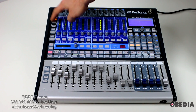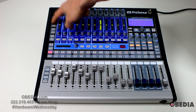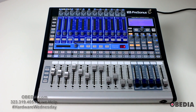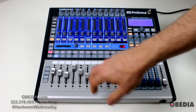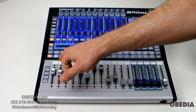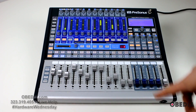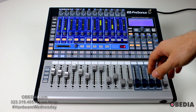The encoders are also multifunction. You can take control of many different features using the encoder strip on the left-hand side of the unit, including controlling the graphic EQ, your FXA and B sends, and your four auxiliary sends. You'll notice a FireWire button on some of these digital mixers from PreSonus — that's important because it allows you to control that channel strip utilizing FireWire on your computer, routing audio back into the StudioLive console by enabling FireWire for the channel strip.